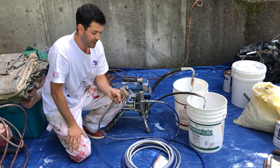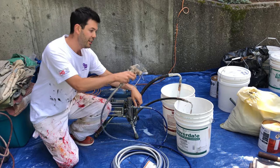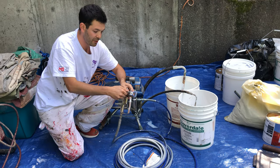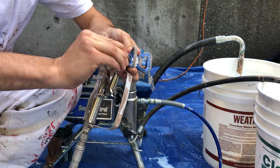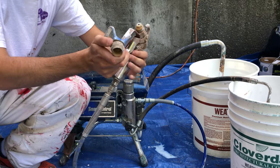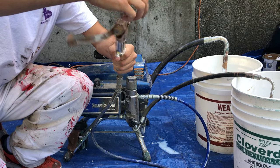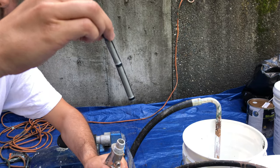When you're completely done spraying and want to clean your machine — say I've sprayed a whole house — I'm going to turn the pressure down, spray out all the paint, then pull the gun apart and rinse it. When pulling the gun apart, I unscrew the guard. First I might take the tip out — there's a groove and it can only be pulled out in a certain orientation. Then I take the guard off by spinning it, because I want to clean inside of this. I take the tip and guard, throw them in some water, rinse them out. Then I dismantle the gun by unhooking and spinning it, and inside there's the first filter — we really want to clean this filter.